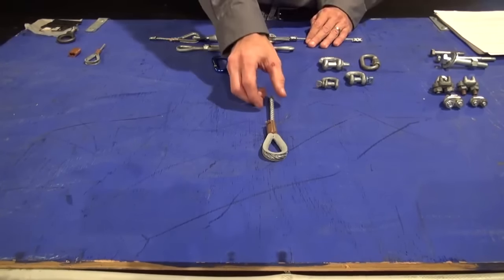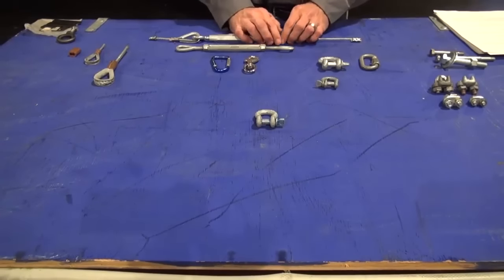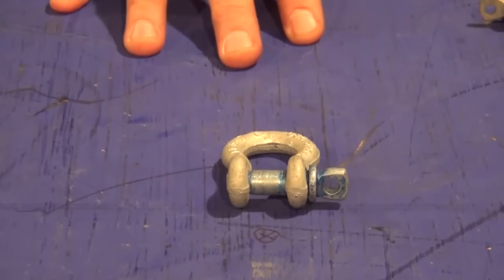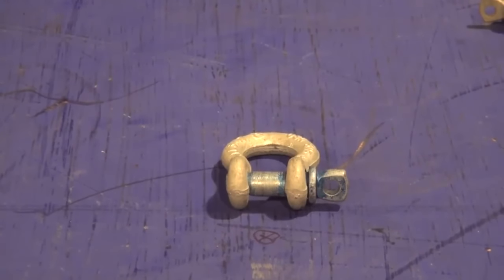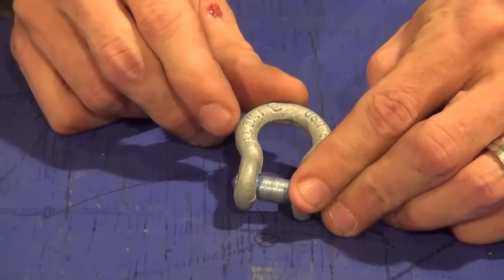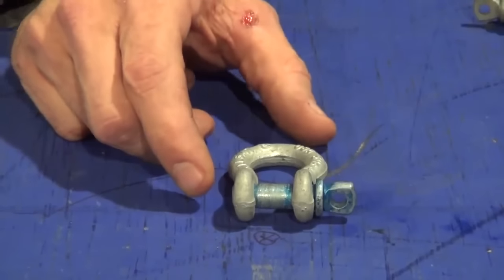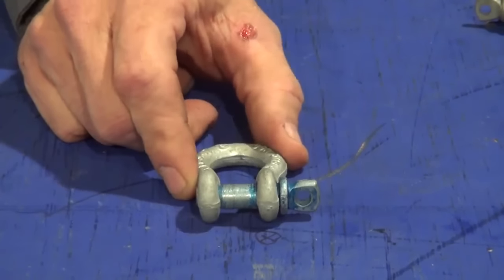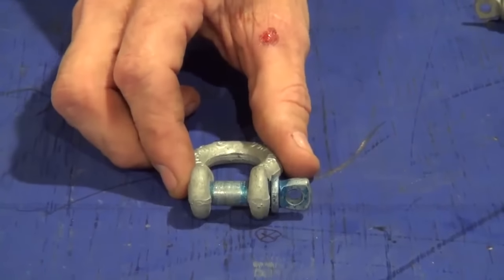With static hardware — for example, a shackle — we apply a safety factor of 5. Static rigging hardware has a safety factor typically of 5 to 1, sometimes 6 to 1. On that type of hardware it's actually going to be stamped. It says the working load limit is 3/4 ton — that's 1,500 pounds. That 1,500 pounds is what we say we can use this for. Ultimately it has a much greater breaking strength, but that's our working load limit.